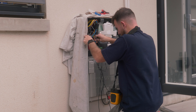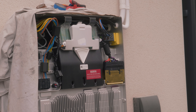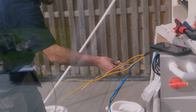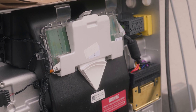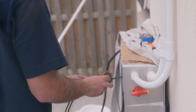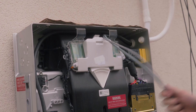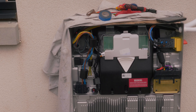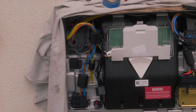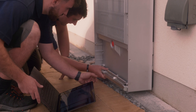Within the Powerwall 3, on the right-hand side you've got the DC isolator which isolates the roof and the Powerwall 3 — there's also a DC isolator in the loft where all the DC cables come back to. In the middle is the main brain of the Powerwall 3, where the communication cables run between the gateway and the battery. In this installation we've got 10mm cable from the gateway to the battery, allowing for an 11.04 kilowatt output. On the left you'll see the black clamps — those are ferrite cores located throughout the battery to stop interference from the cabling affecting surrounding components.